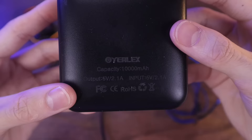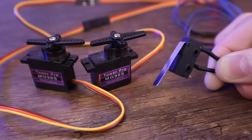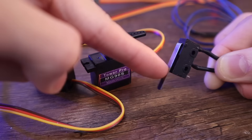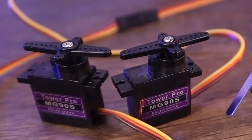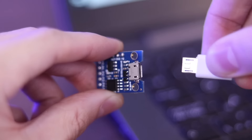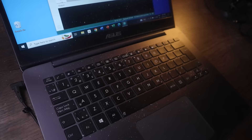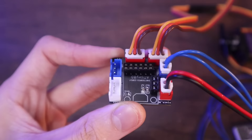This board requires a 5V 2.1A power bank — which is a separate power bank from the one powering the LEDs, because this power bank doesn't output enough current to support both things at once. Once the board is plugged in, I can press the limit switch, and the servos should rotate like this. By default, the servos will rotate about 140 degrees, but I would like them to rotate about 40 degrees less than that. So I removed the microcontroller from the PCB, plugged that into my laptop, and did a bit of research to figure out how to edit the code. Once I had that all figured out, I mounted the microcontroller back onto the PCB. Prior to this, I had never touched a single line of code in my life, so this kind of felt like magic.